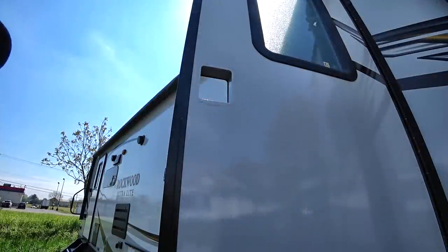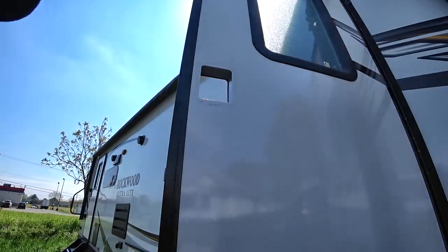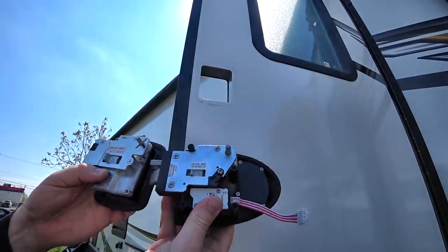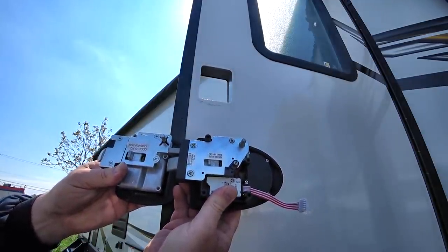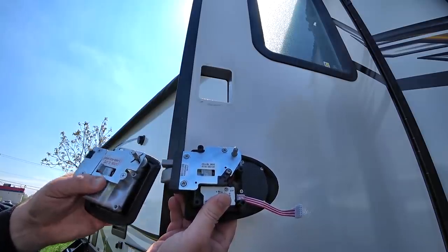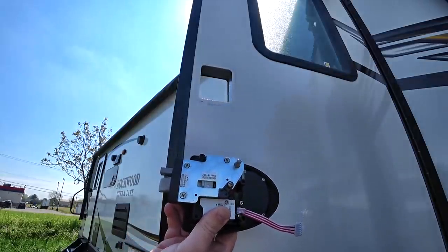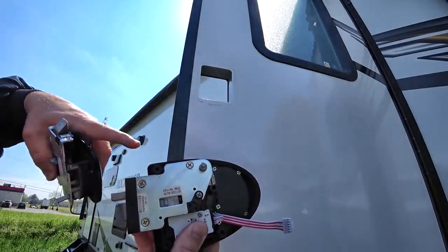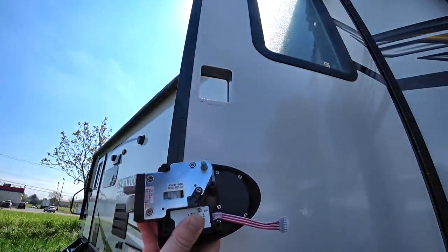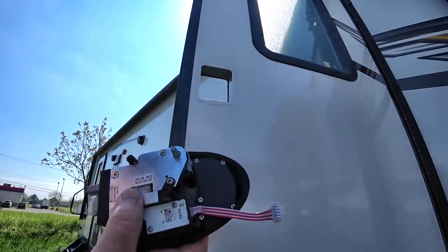There's been a lot of talk about these on YouTube in the RV realm about the openings on your door. You have this kind of lock initially and it could be that the opening is cut kind of big, but essentially it's the same layout — their outside handle is a little more fancy to accommodate the keypad. So the opening and sealing off against the door without any gaps is the main concern. They do address that issue — there's a rubber gasket already on it, plus an additional decal gasket you can apply to take up any gap and keep water out.